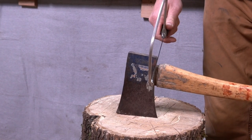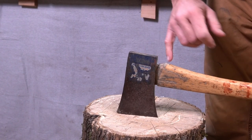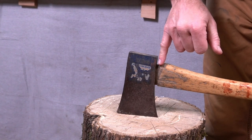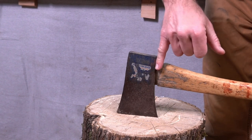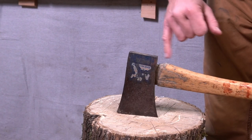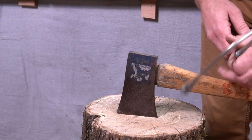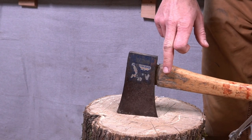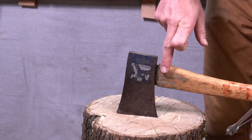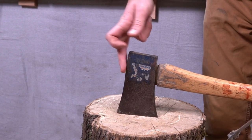I'm just going to take a coping saw. The goal here is to get your handle out of the head a little bit so you can see the wood that was inside the eye. If you get into the handle wood that is outside of the eye, it starts tapering up and you're going to be pounding thicker wood through the eye. So you do want to get the wood that was inside of the eye. If you can pull it out a little bit, great. Otherwise, take a file, rasp, or something and sand this section down so it'll go through, because we have a smaller eye on the bottom than on the top.